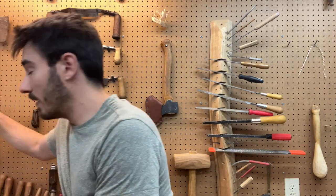So I took it home, I carved with it. And the good things I have to say about it are that the bevel is great, the steel is great, and it comes sharp. But that's about it. In general, I find Flexcut tools to be a little bit gimmicky and designed in a flashy way, designed to get your attention and not actually to work that well at their intended function. This draw knife was no exception. They claimed that you can bend it to reach the spot that you're trying to carve, sort of like a cabinet scraper. But the difference is that it's an advantage in a scraper to be able to bend it, whereas if a draw knife bends, that means it's flimsy crap.